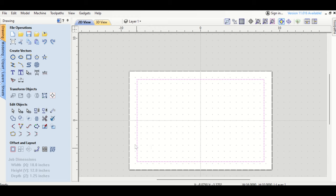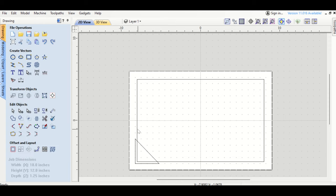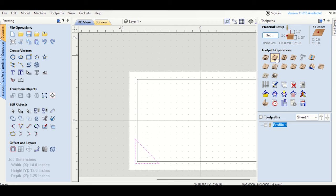You can use other shapes — you're essentially just making a pocket. Using the grid lines is really helpful for dimensions. I make my triangle just a little bit bigger than the line itself. The tool I used was three-quarters of an inch, so it came out three-eighths of an inch on each side. For the pocket, cutting within it should be fine. Then go to Tool Paths and do a Pocket toolpath.